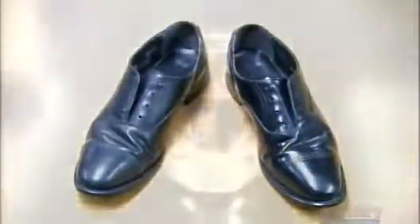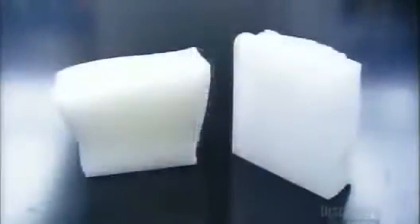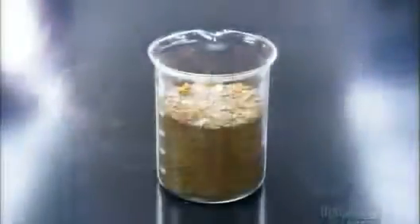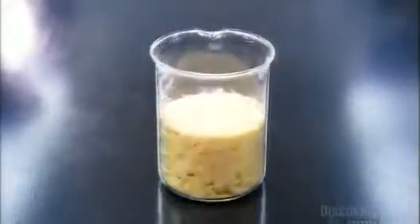To make shoe polish, they start with mineral spirit solvent and different combinations of carnauba wax. They load the waxes into a wax melter and heat them to 127 degrees Celsius. They cook for 15 minutes while beaters blend it all together.